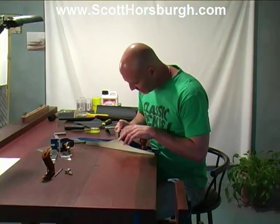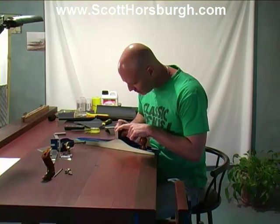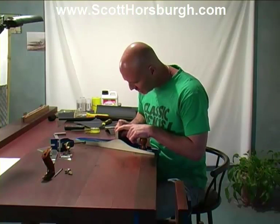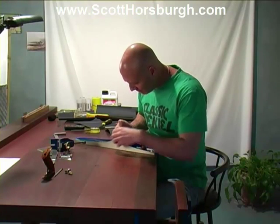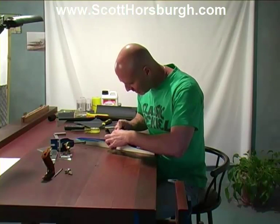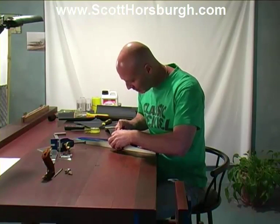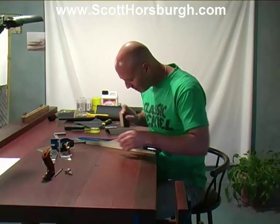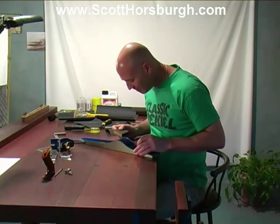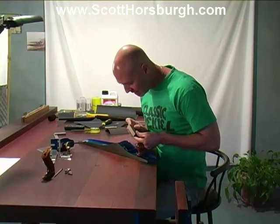I'm going to place that on to the mating surfaces, and I'm just going to feel the level. By rocking it from side to side, you can feel where the level is. Now, it's 240 grit and the range of movement is very slight. Once you've done a bit, you can take it off and you will be able to see where the high points are.